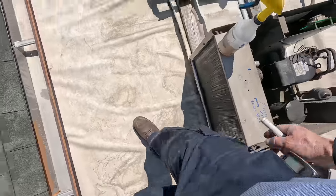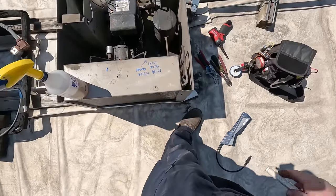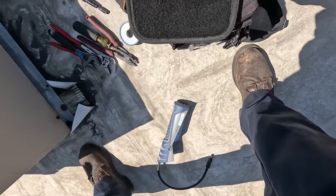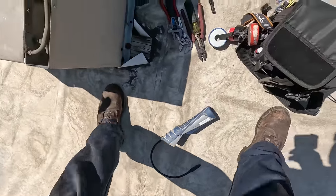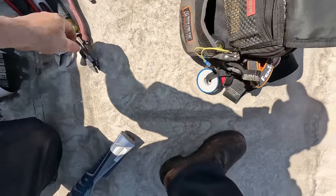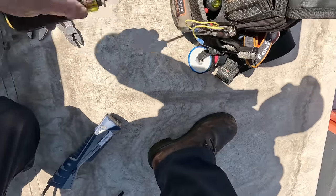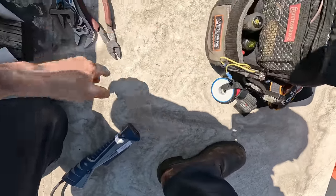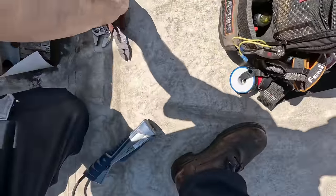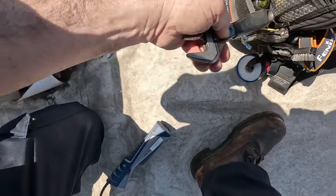We'll do it when it's running with high pressure on it, but it's no different than a screw-in pressure relief valve for a liquid receiver tank. We usually use pipe dope of some sort, usually like a Loctite brand white stuff. I forget the 700 number or whatever. It works, either way. Let's go grab some go-go juice. This should be 404. Let's see, yeah, it's POE, so it's gonna be 404. And get this thing dropping in temp.